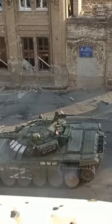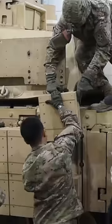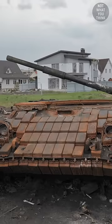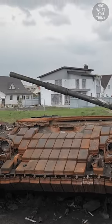So why is it that anti-tank rounds could set off the boxes, but not bullets? The answer is that the explosives inside these boxes are insensitive, meaning the only thing that would set them off is an extremely powerful shockwave — not shrapnel, bullets, or heat. That's why you see footage of tanks that are burnt down, but the boxes of reactive armor have remained unexploded.